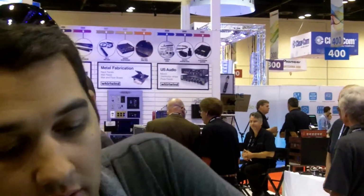We've got a brand new infrastructure for the network we're talking about. Twin lane is the backbone of the system. You have 400 channels at 96K. It's an incredibly powerful network. Each RPIO input-output unit can have up to 96 inputs plugged in. You can also have a Dante card with over 144 inputs and 2 MY card slots for an extra 32 inputs and outputs. So you have a ton of input processing.